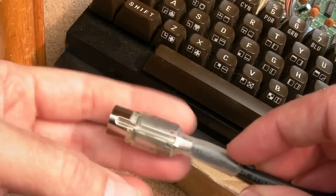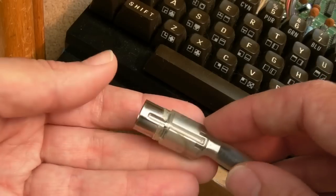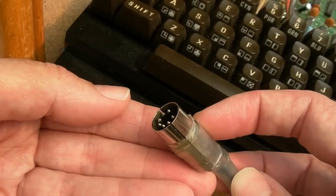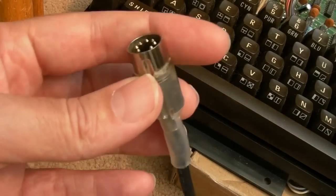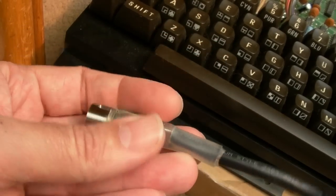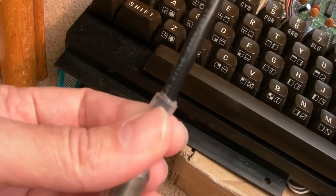And the reason this was getting hot, the thing that I could smell, was this, because it was obviously cutting in, and the MOSFET in there shorts the power to, it might be an SCR or something, I think shorts the power to ground, which is why this warms up. So yeah, that's all the issue was.